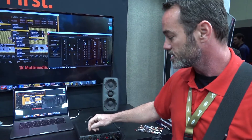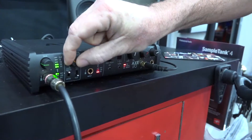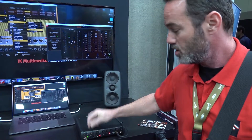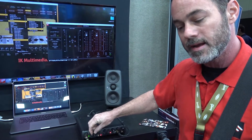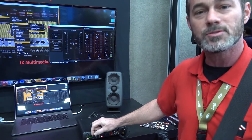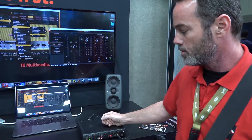And this is what's really cool: the Z-Tone knob right here will actually adjust the impedance of the incoming signal. Depending on where you put that, a high impedance is going to give you a sharper, tighter feel. A lower impedance will be a broader, warmer, bolder sound.